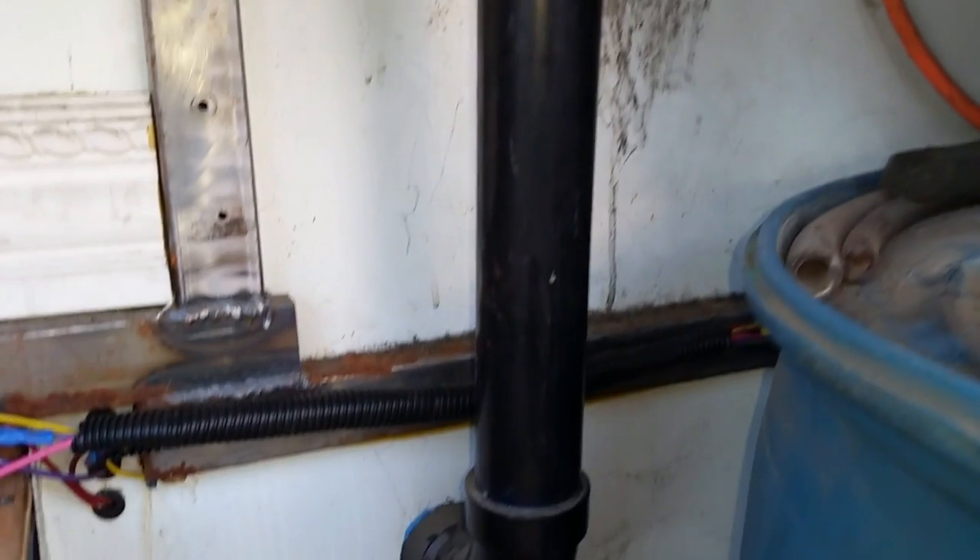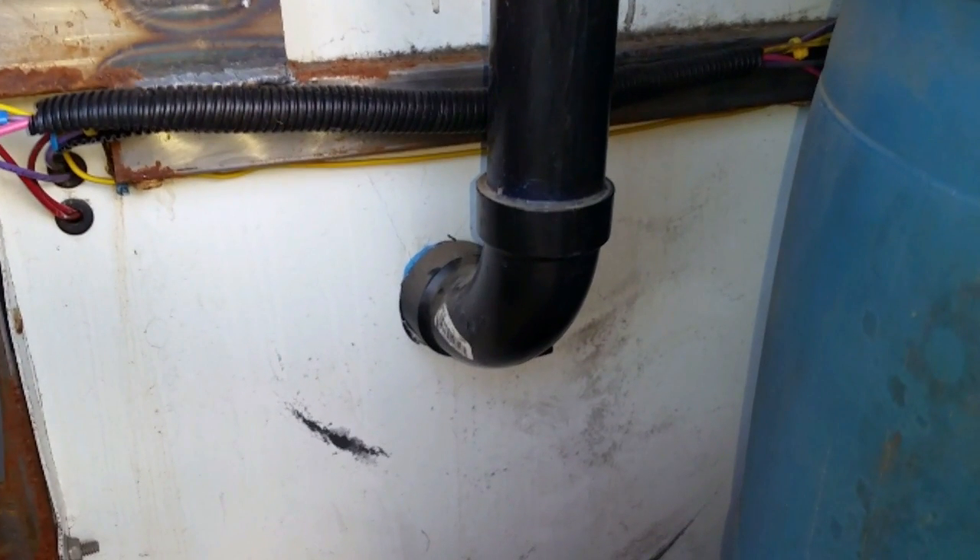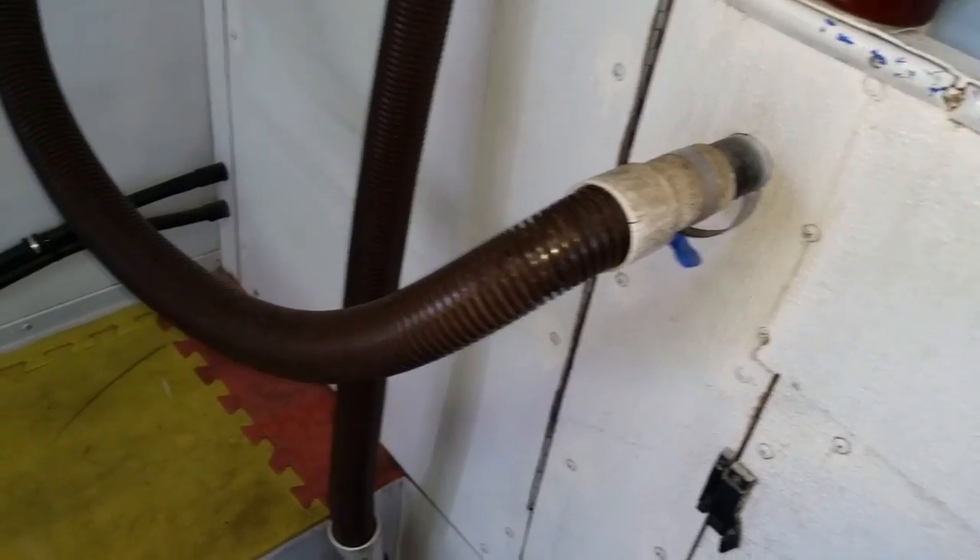The output of the dryer connects to a one-and-a-half-inch ABS drain pipe. I use sweeps instead of elbows to cut down on the resistance to the airflow. Then I pass the pipe through the back wall into the closet, along the side to a reducer, then through the front wall to the hose connection.